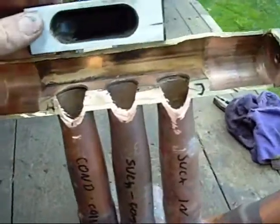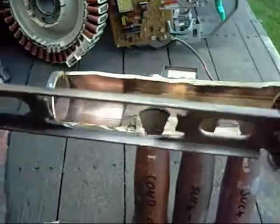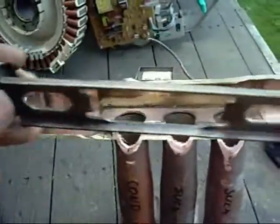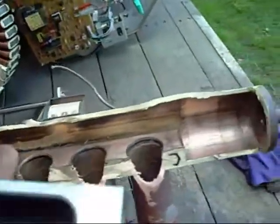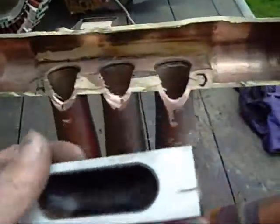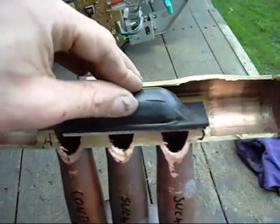A fairly simple design. As I said before, the solenoid here takes high pressure gas from the high pressure discharge side of the compressor and uses it to push this little sled forwards or backwards depending on which cycle is required. Pressure equalisation in the surrounding chamber pushes this Teflon seal hard against the bronze slide plate and creates a nice seal.